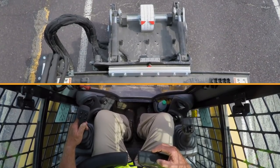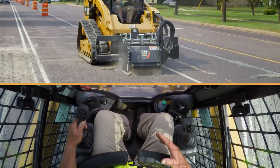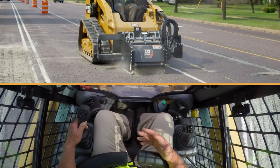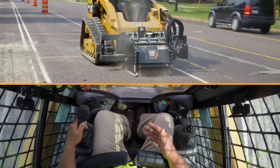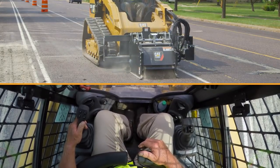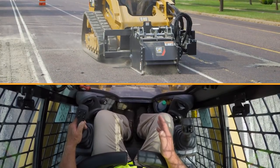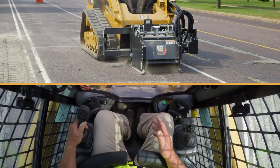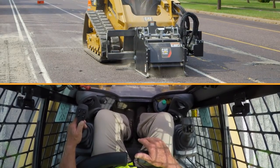As we move forward with the PC-306B with all these controls in motion — creep control, continuous flow, and self-leveling shoes set to the right depth — all I have to do is steer the machine. I do not have to worry about where my shoes are, because they're finding their own center. Nor do I have to worry about the head, because it is following the contour of the asphalt.